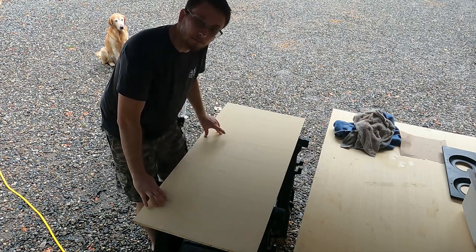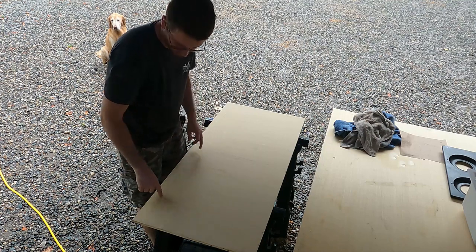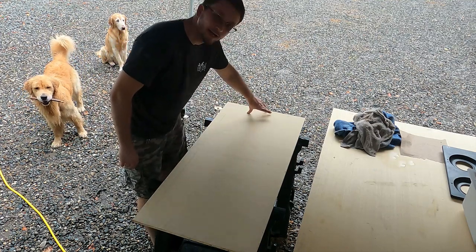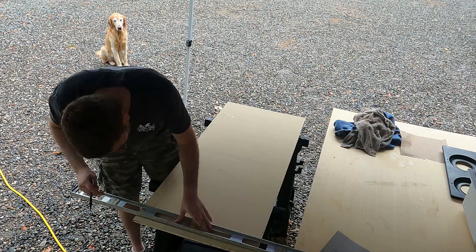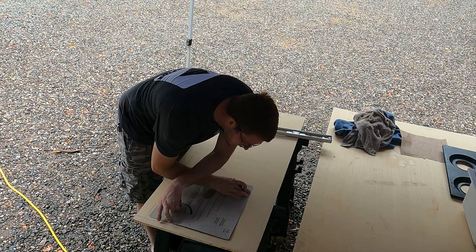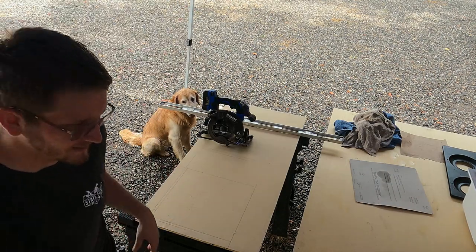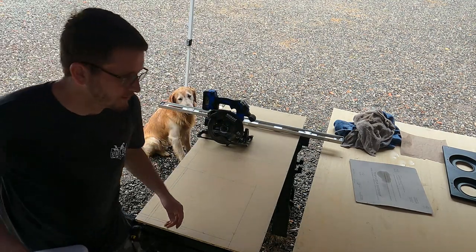When I had this inside test fitting it, I laid it down and marked out where all of the studs are that I obviously can't cut a hole through. We're going to try and place the sink as close to this corner as we can, and stick the stove as close to this side as we can. Since I have these marked, I'll take the level straight edge, continue that until I get a nice corner, and place the template to figure out where we want to cut. I'll go ahead and measure with the sink first to make sure the sink's not bigger — I should be able to cover all my lines with the sink.